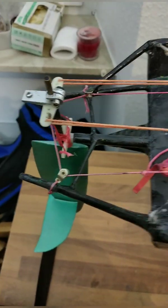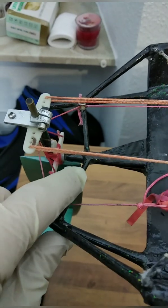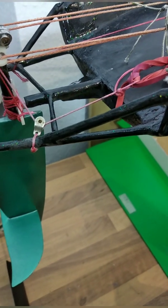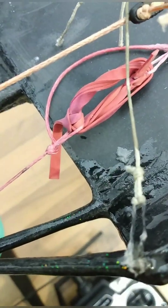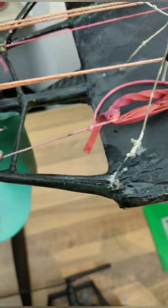You can see it here: I built a gantry out of carbon fiber tubes and rods. The thin ones are just rods, but the others are all tubes. My typical little flake in the resin — those tubes have been sanded and coated with just one layer of clear polyester resin. The joints are stiffened up with carbon fiber. It looks a little rough right now but it is structurally solid.